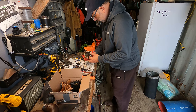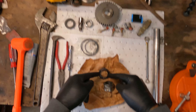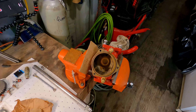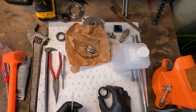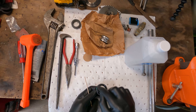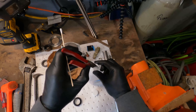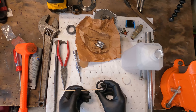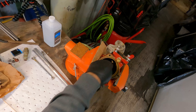Now we have the bottom end of that mechanical seal right there. You can see there's a chip in it — that shiny graphite. Gotta pull that out of there. That was easy — got an easy button on that one. For the new mechanical seal, even the dumb fisherman in me knows not to touch that with your greasy fingers. You've got to put gloves on or you'll burn it out — it'll scar it and leak, and you'll be screwed. So that's going to go right in the hole there. I got some grease on my gloves and then some prints on the seal, so I scrubbed it off, but there's still grease on there. So I'm going to take some isopropyl alcohol on a Q-tip and clean it off so there's no chance of grease on it. Down in the hole it goes.